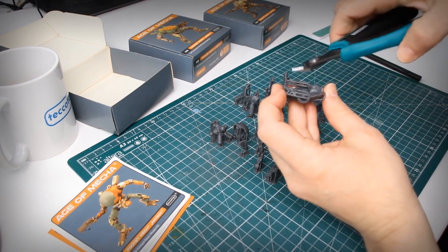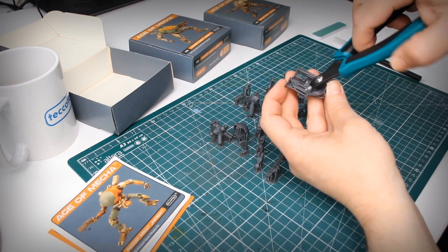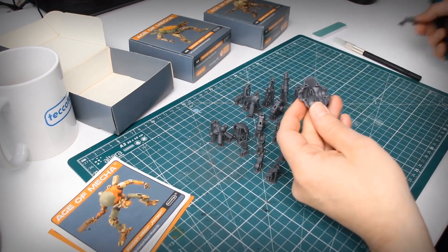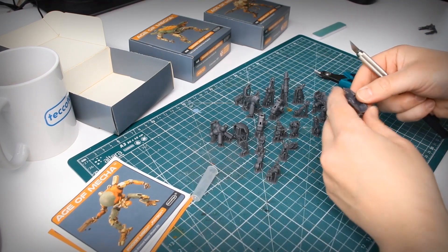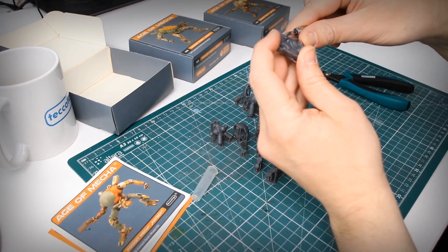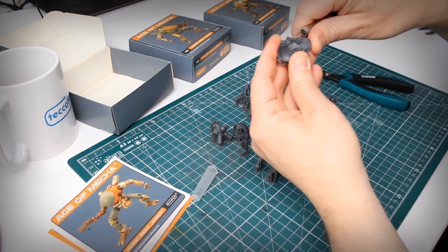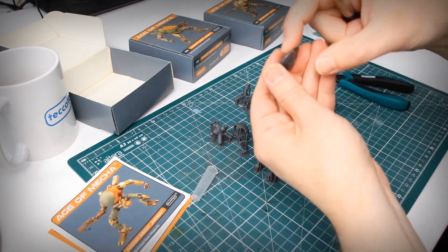You don't have to cut all of them. Usually some hard-to-reach leftovers of the support structure can be wiggled away — they just break off. Get rid of that garbage. Then what I usually do is take a hobby knife, a sharp scalpel, and just slide over the flat surfaces to get rid of the small contacts. Try to get it really flat and even — you can check from the side.